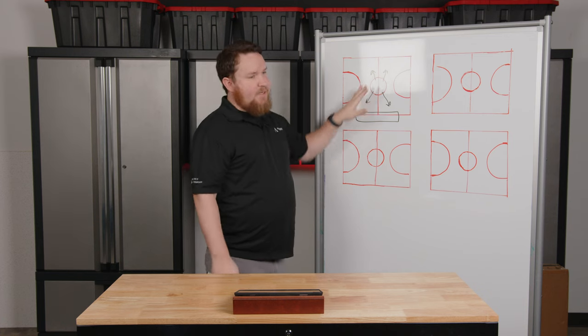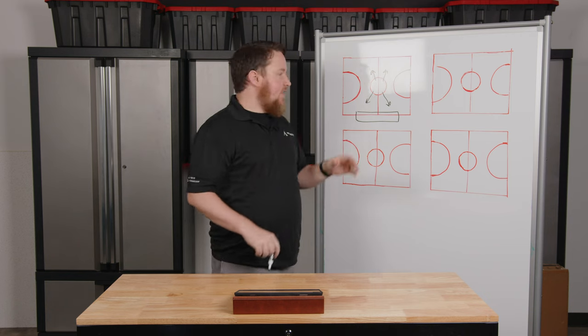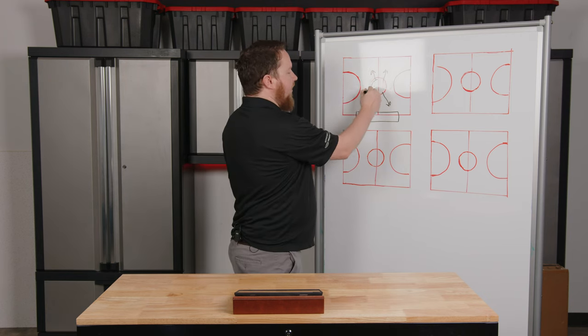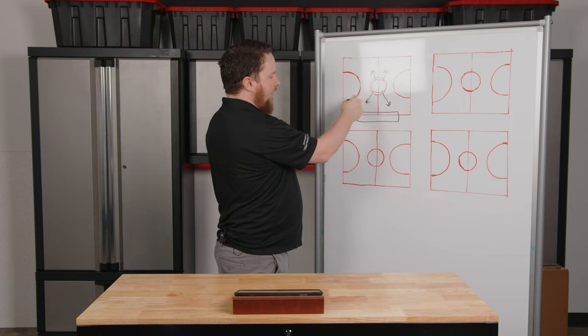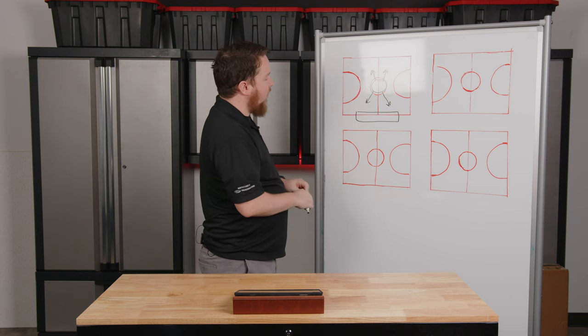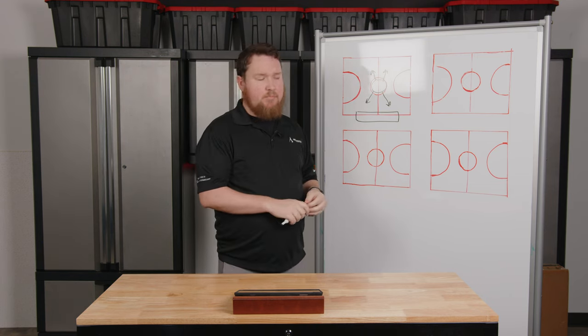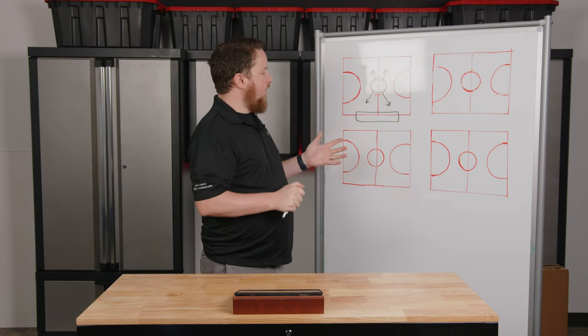This same basic concept can also be done using an Octasound type speaker, which instead of having four individual speakers is basically one big sphere with built-in horns to fire in a north, south, east, west type of configuration. That's a specialized option we can look into for covering a gymnasium. There are pros and cons of both, but definitely something we can take a look at.